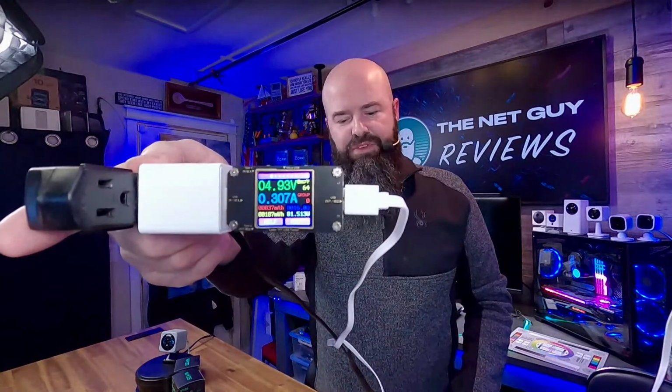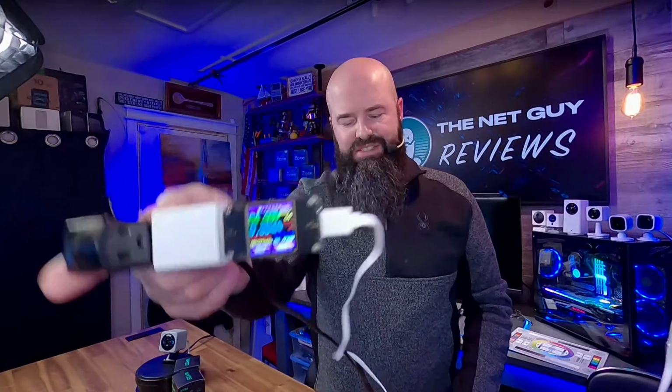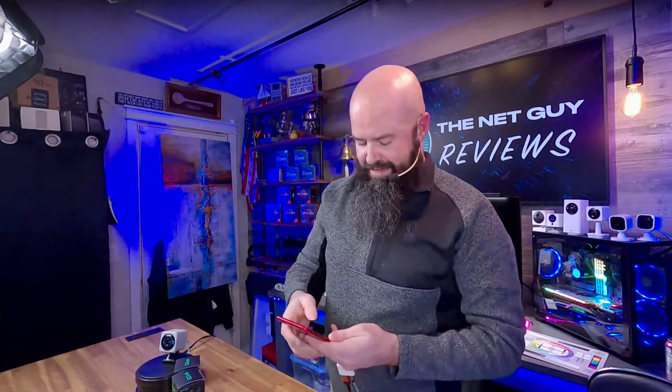Okay, taking a look at the chat for questions. No questions on there. So now my Pro is fired up, and you'll look at the resting power draw on the Pro. So that's 5 volts. That's going to be 300 milliamps. So it's about 1.5 right there, resting power draw. Let's go ahead and turn on its spotlight, and we will see what it draws. So it can draw up to 2 amps with the faster CPU and other features that it had.